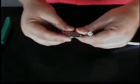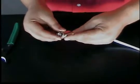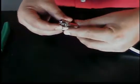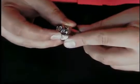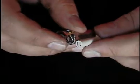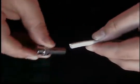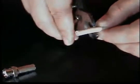Now we're going to take a look at the twist-on — it's just like a nut. Typically what you'll do is try to get it ballpark to where the center conductor is for the connector, and try to match it up with the length of your connector. If you haven't done these in a while, it'll take practice. Once you do one or two of them, you've got it down. So let's go ahead and strip the jacket off the coax.